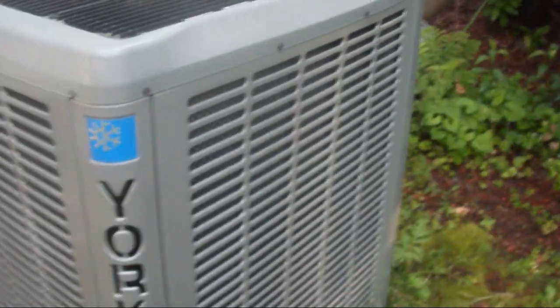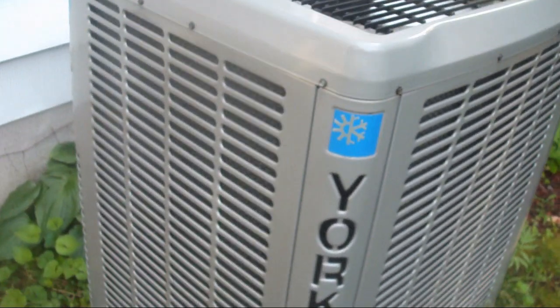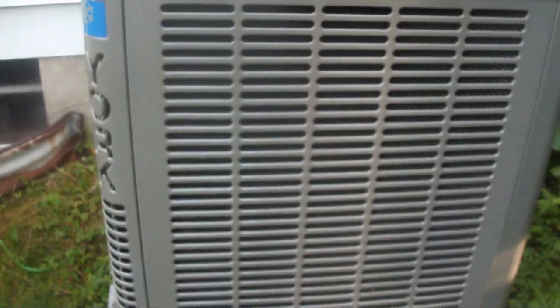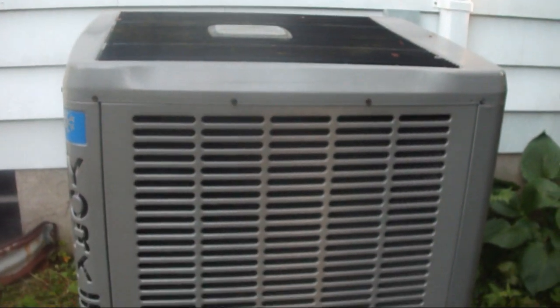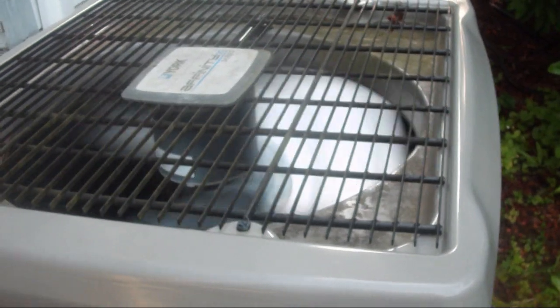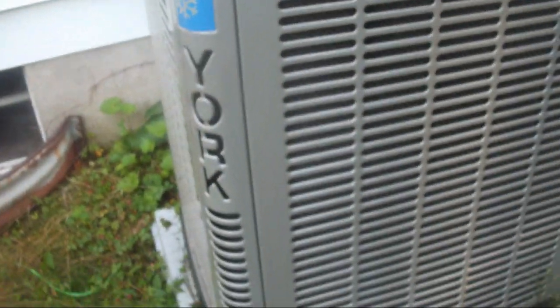Meant for a straight cool central air conditioner with a gas furnace, a split system. Or actually, you know what? I think those thermostats can do package units as well. But even though the forced air system doesn't have any heat, it's just an air conditioner. It's a thermostat that could be used with a straight cool air conditioner and gas furnace combination. It didn't have the little EM heat thing on it. So it's just for a gas furnace or an oil furnace and a straight cool air conditioner. But yeah, this is my friend's 2006-ish York Affinity Series central air conditioner. Really nice unit.